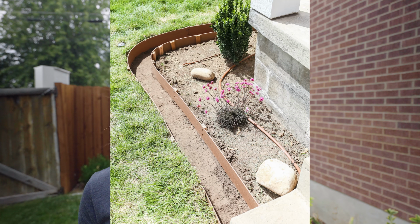This gap will represent the width of your edging, which you should have your edging a minimum of 4 inches. But you also need to factor in the width of the material you will be using to hold the wet concrete together. This is your concrete form. To determine this, take the width of the edging and add 2 inches. If you're using 2x4s, I would suggest adding 4.5 inches. This is how wide you need the gap between your border and the dirt.